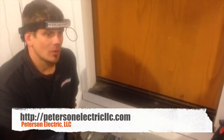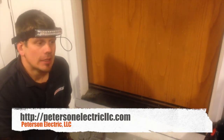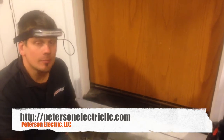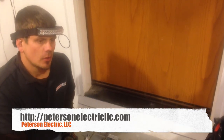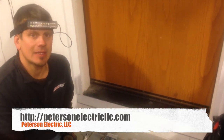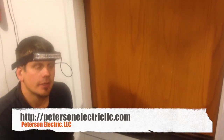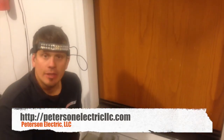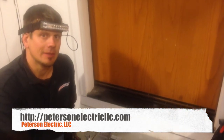I want to show you why we had an issue with this radon fan that was popping the circuit. Radon fans probably draw maybe about one amp, maybe even a quarter amp on some of them. Technically you could tap them anywhere on a circuit and usually not have an issue, but the code does state that most any kind of dedicated piece of equipment — especially a life safety item like radon — should have its own circuit. But these guys didn't; they just came off the outlet up there and piped it down about 20 feet.